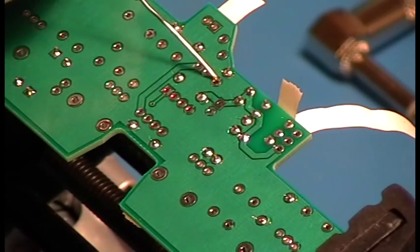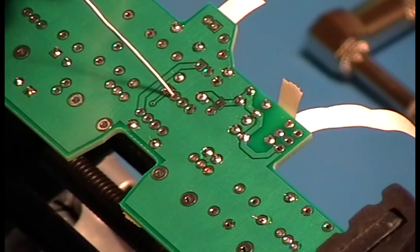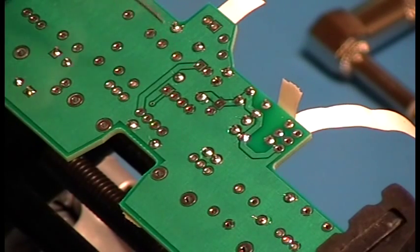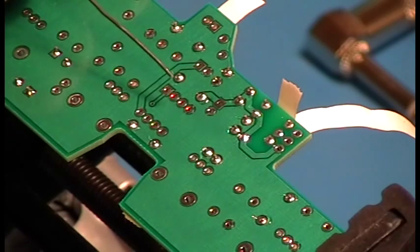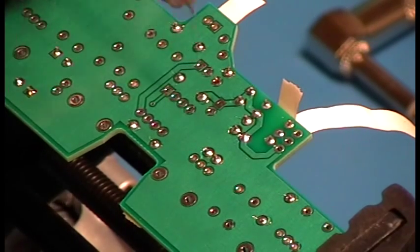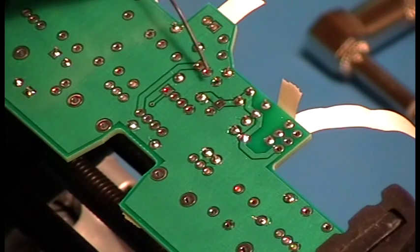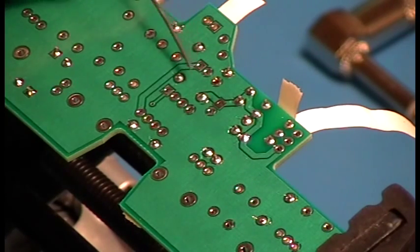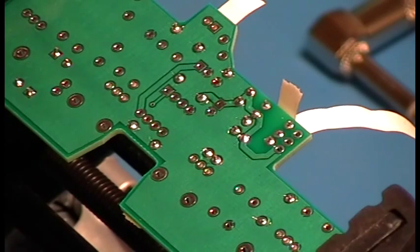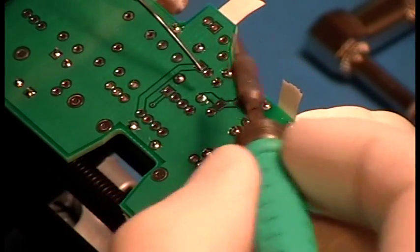Okay. And the spokes are there because heating up this ground plane is really hard, even with a fantastic iron. That's a lot of copper here to heat up. If you didn't have the thermal relief, it would be very hard to solder. Still, even with the thermal relief, it still takes a little bit of extra oomph to solder these particular joints. So I'm going to do everything exactly the same way, except before I feed the solder from the other side, I'm going to give it maybe an extra second to heat up. I'll actually be able to see the solder start to flow, and then I'll feed it in. So this joint's going to take just an extra second or so to do. If you're making your own boards, when you get to those thermal reliefs, take a touch extra time, because if you don't, it probably won't flow right.